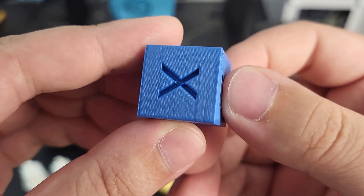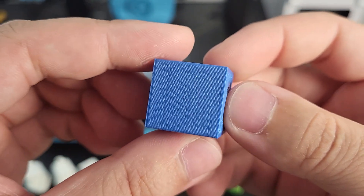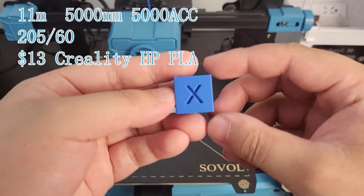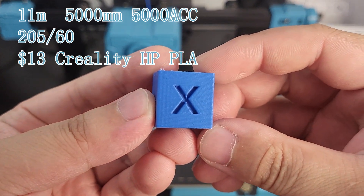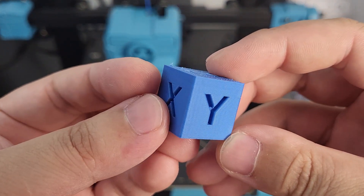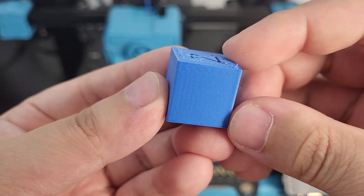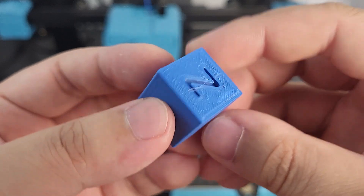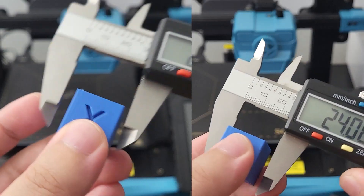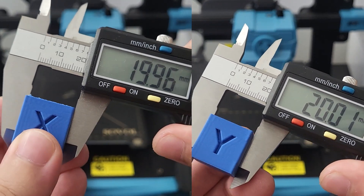Let's put it at a 45-degree angle under a strong light source. I further increased the acceleration to 5000mm/s² — it cut about 2 minutes of printing time, which is not a lot, but if you do the math it is around 20% printing time reduction. The print still looks awesome, and all cube dimensions are accurate, beside the Z axis.